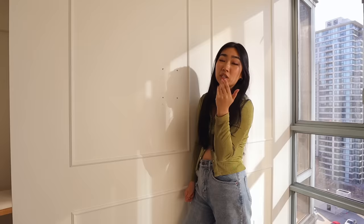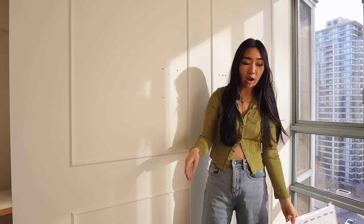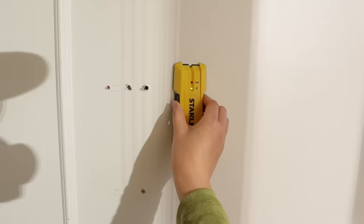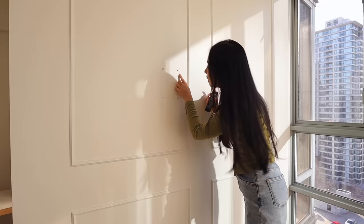They have a bunch of different options with the TV mount to drill holes into for different types of wall situations. Now, I just don't even think that there's a wood stud in here at all, because it lights up right here and then it also lights up right here. So we thought that there were two studs like this, but no, I think that this entire thing is actually just a sheet of metal. When we drilled it in, we see the metal right there, which is not good.